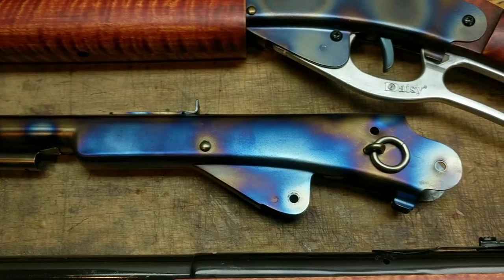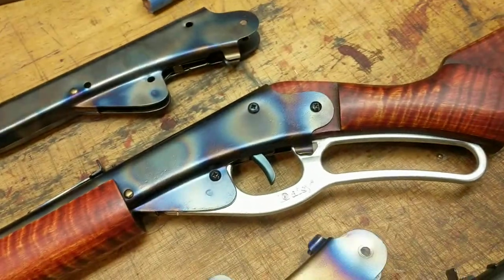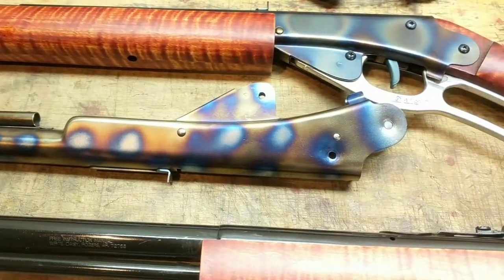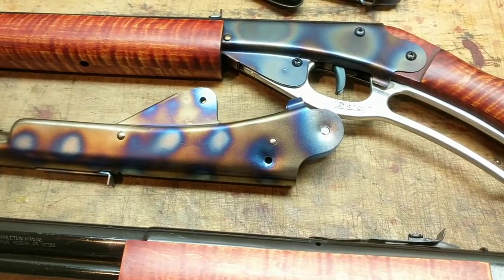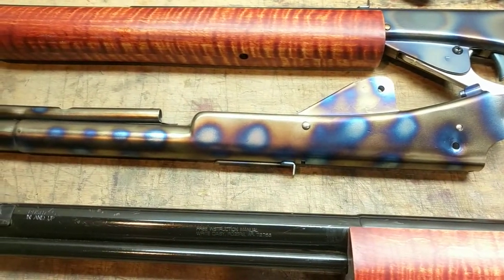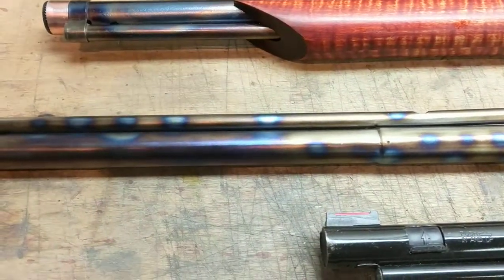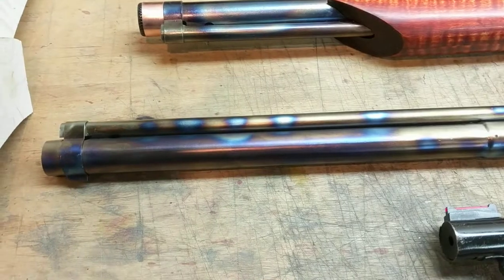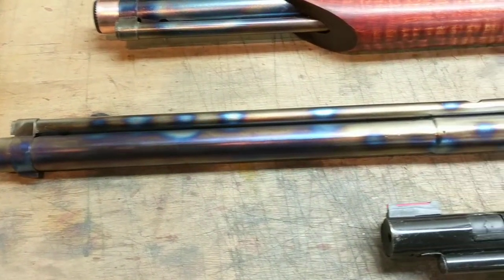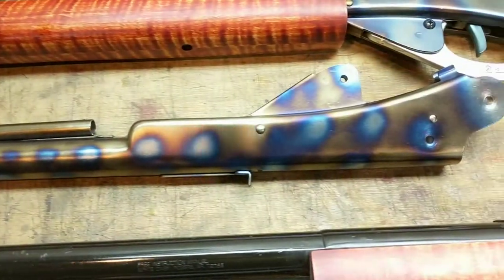On this particular exercise I am pleased with this side of the gun. The downside is I'm not too pleased with this side of the gun — not that I'm done with it yet. I'm going to be experimenting some more on this particular piece to see if I can get some of this gold out and get some more dark blue going. A lot of this work depends on the flame source and your orientation, and I don't exactly have a rotary bench to be able to manipulate these easily while the flame is active.